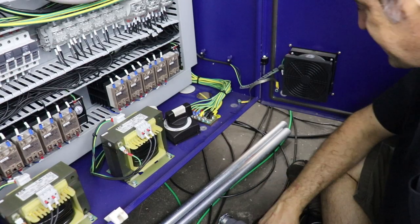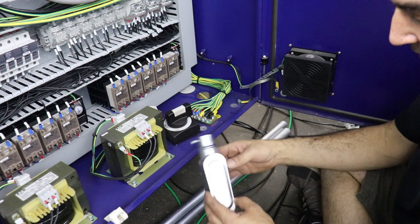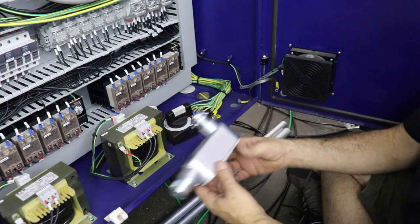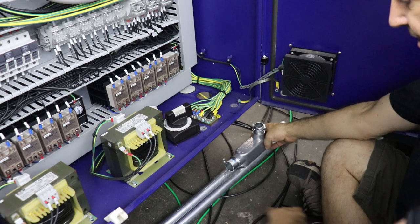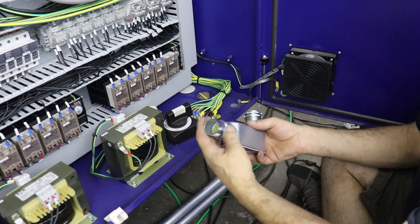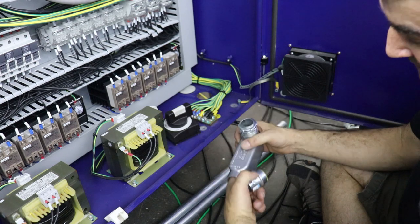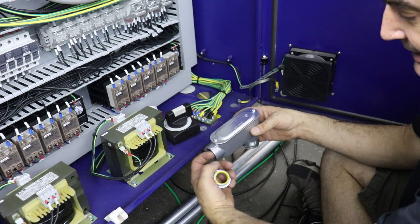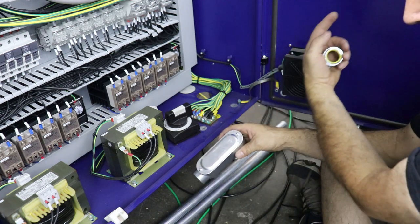All right, so we're getting pretty close to the end here. This is the final run of conduit that I just bent. So this box is called an LB, and I don't know what that stands for, maybe low profile box. But anyway, I use these at the end of a conduit run. It goes basically right here, and the wires go into this threaded adapter from an EMT to a threaded conduit. The wires go into this guy, and then you take this cover off, and it allows you to pull wire up and out this cover with less of a bend, so you can pull all your wire through,